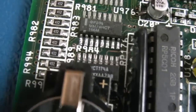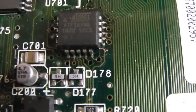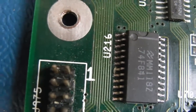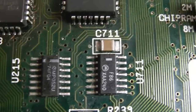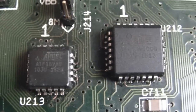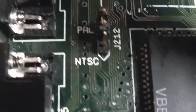Yeah, so testing at various stages, so you can see it is a bit dirty. I'll hover around, we'll try and focus something like here. Yeah, some of the wires around that GAL there. Dirt between the legs on that chip there. Jumper's looking a bit dirty. So over a period of time, it's a bit dirty, and look at these wires here. Some of these, I'll tin these wires up, clean around these chips, reflow where I need to. And then up here, if I can get there, these jumpers, you can see how bad these are.